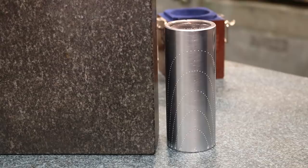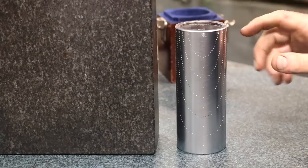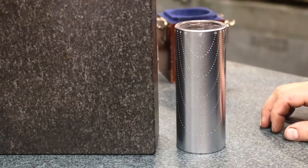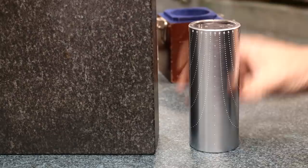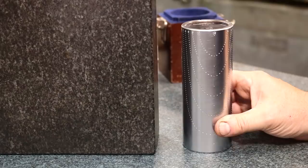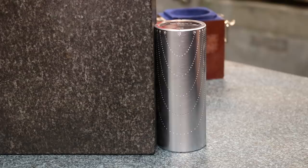I've got a video that I show how to do that. What's cool about this cylindrical square that makes it different from other ones is that you can flip it over — it's marked on there as to which side goes on there. When you flip it over, it's actually ground where it has a little bit of tilt to it. I think it's about one thousandths of an inch of tilt — actually it's one point two thousandths of tilt depending on which way you go. And what you can do with this: right here on this side it's got some numbers in ten thousandths of an inch — zero, two, four, six, eight, ten, twelve — and you can actually get an idea of how far out something is from square, as long as it's in that resolution, by turning this square.